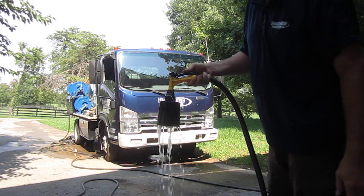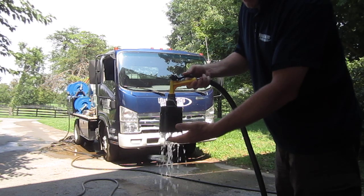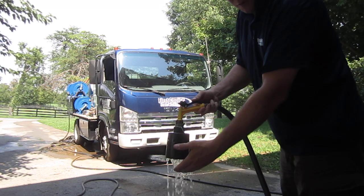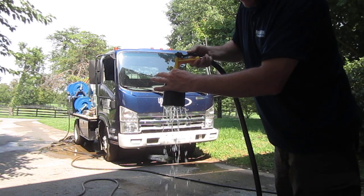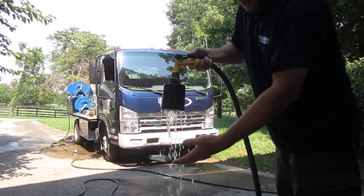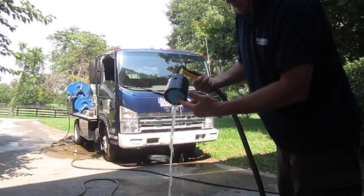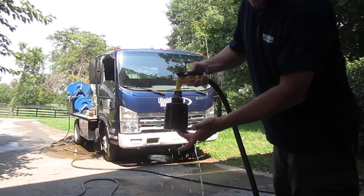The water is filling your tank, but once that water reaches this level — at the base of this — and you can put a longer tube on there if you don't want to fill up more than half your tank. But this is basically right here at the top of my tank. When that water hits the bottom of this and it hits this little float piece — you see this little blue plastic — it floats up and shuts this valve off.